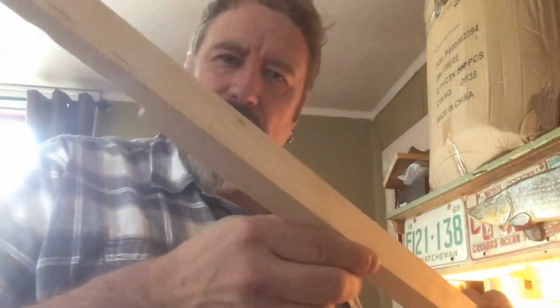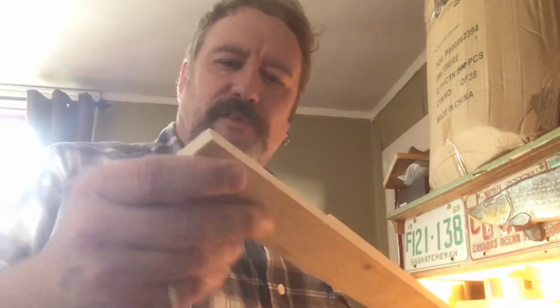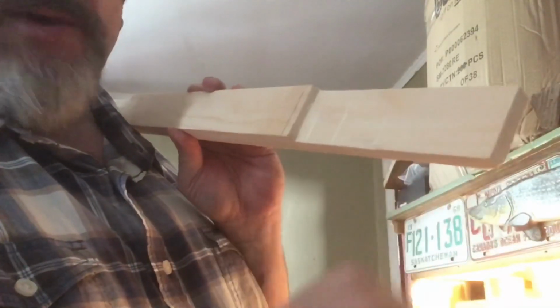While that box is gluing up, we have the squared off neck to round over and the headstock to install the tuners. We want to get rid of these tool marks a little bit too. I'm going to work a little bit more on it, but I'm not too worried about perfection there. It's still pretty smooth.